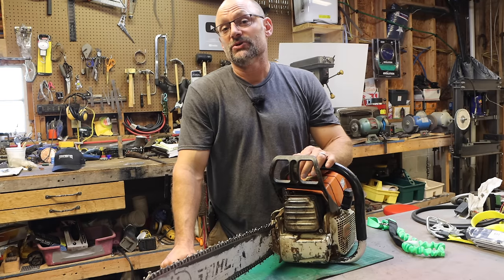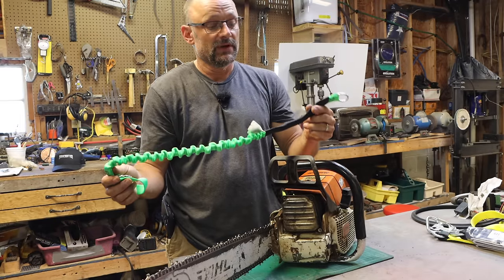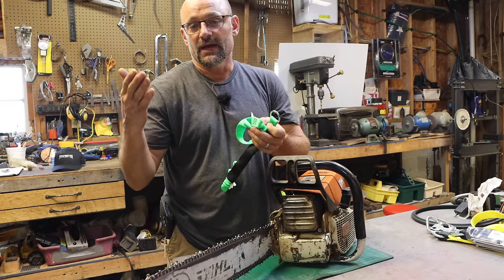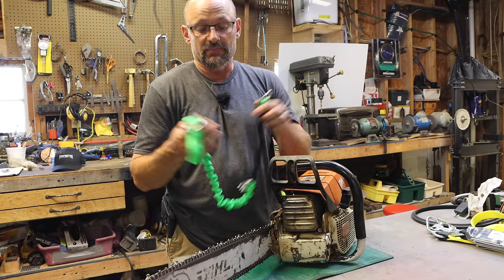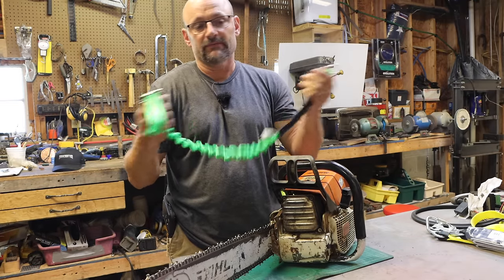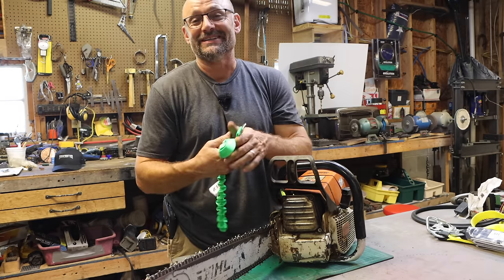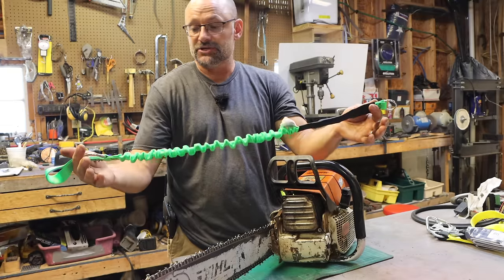I talked to him about what you're supposed to do, and they make this, which is an interesting device. This is a breakaway chainsaw lanyard. This will break if it gets more than 200 pounds of force exerted on it, because exactly like my initial concern with tethering it off, if you take a hard piece of webbing and attach it to yourself or to the lift and it gets jerked and snaps back at you, it's going to cause serious injury. This prevents that. It will catch the saw in most cases because it's going to be less than 200 pounds of force. But if it's really embedded hard in a giant log and it's just going to rip, then you want the saw to go. You want it to get away from you. You can buy a new saw, you can't buy a new face when your saw comes back and smacks you in it. So yeah, I'm real glad to have this. This is the area that has the 200-pound breaking strength in it. Yeah, that's a nice addition to my kit.